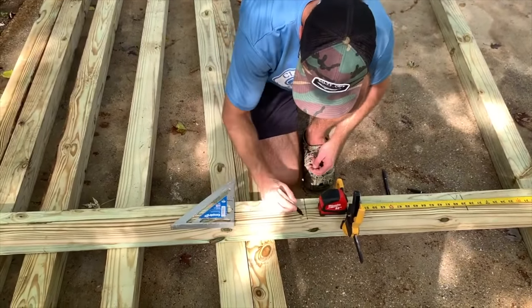After applying enough of this accent epoxy for my liking, what I did is I grabbed a 9-inch roller, and what I'm gonna do is I'm gonna basically just swirl the accent color into the slick coat. And this is gonna give us a nice kind of metallic look that's blended together, which in my opinion looks pretty cool. Continue to blend in the accent color of epoxy with the slick coat, and you can basically just blend in this circular motion that you're seeing now.